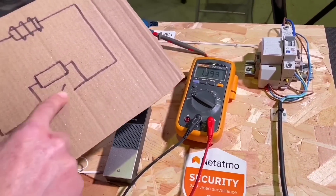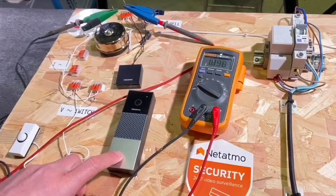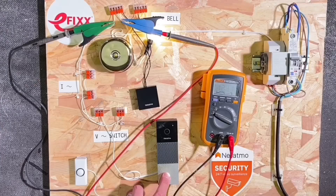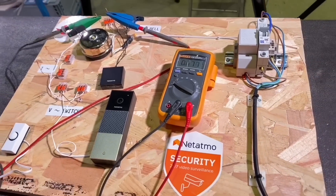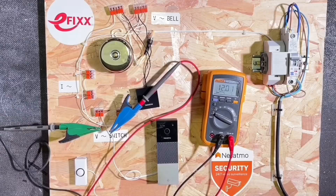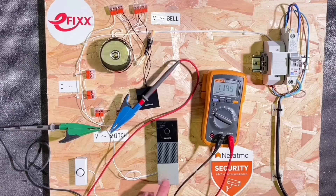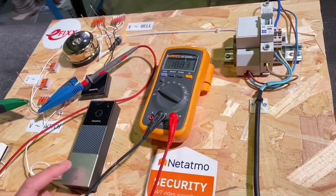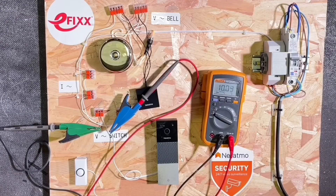All right, so will that voltage change? Well, just remember we're shorting out the circuit with the switch at the bottom — fully working — and we've got 12 volts across the bell like we experienced earlier. So what's happening there then? So that device, when the bell's pushed, is switching itself out of circuit. Ah, that makes sense — so it's in circuit to get rid of the juddering, but when pressed it pulls itself out to allow the voltage to go across the bell. Yeah — now that's clever. So the switch is going to a very low voltage, and then back up — you can see we've got 10 volts across the device when it's in circuit, because it's having to charge that battery. But again it's changed the ratio in that potential divider network we had earlier.